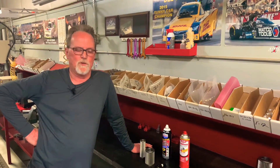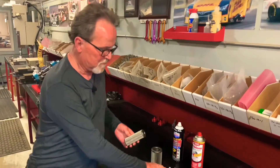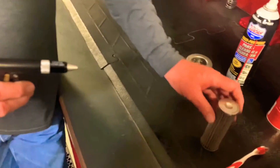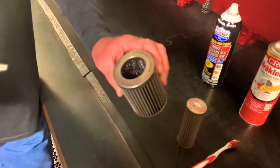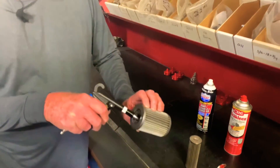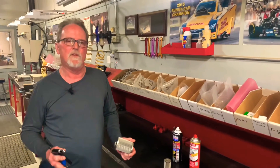Now for the guys that are going to be down for quite some time, we recommend that you take the fuel filter out and clean it up, blow it all off with compressed air from the inside out. Same thing with the spin-on style — with a 10 micron spin-on style — clean it all up, blow it from the inside out, and then put it back in the filter itself and leave it dry.